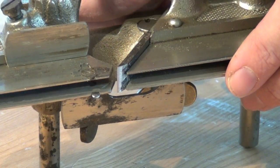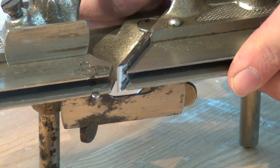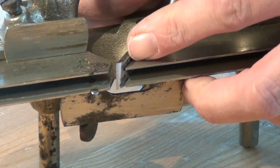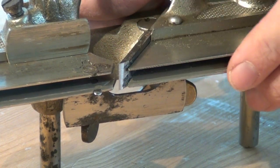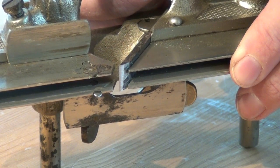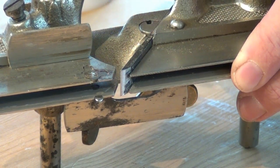Now I position the sliding section so that it gives support to the blade in the area towards the edge of the cut. Because it's a half inch cutter, some of it's going to be hanging over the edge when we're only cutting three-eighths of an inch.